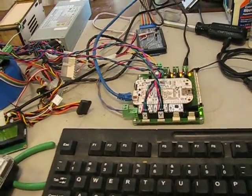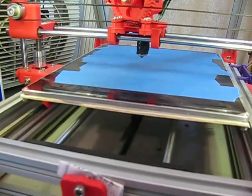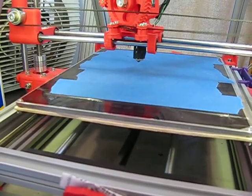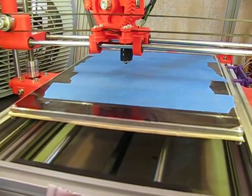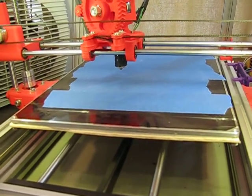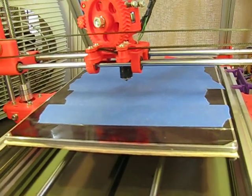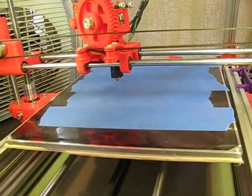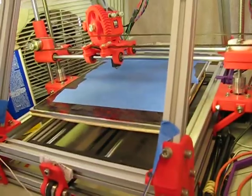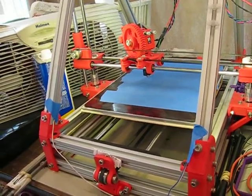PWMs and four steppers are supported. It's just moving around — it's a little bit slow. This is the Linux CNC code; it's not made for printing in plastic, it's made for cutting metal, which is why it moves slow. The rapids are actually not too bad. I only got it set to 200 millimeters a second maximum velocity, but 3,000 millimeters per second squared acceleration, so it moves pretty quick when it wants to.